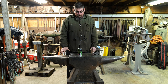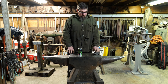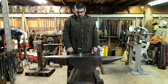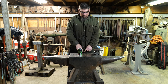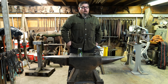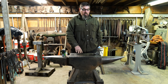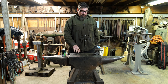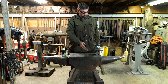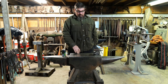Once all of that form work was done, I did hard face the anvil because the materials I was using were not particularly hard. I preheated the whole thing with some big mobile gas burners, and then it took me about seven hours to hard face this whole section here and a couple of additional hours to do this. The rod that I used is a Hobart product called Hard Alloy 58, which recommends that it not exceed two passes. I was using a three sixteenths diameter rod. I just laid in passes one right next to the other and kept going, chipping off slag between passes or using a wire wheel to clean things up.